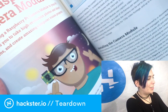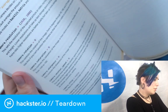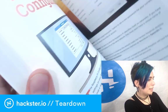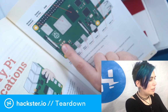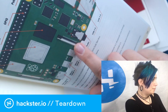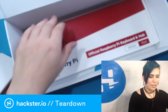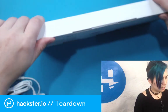And then the camera module, making your own little smart glasses, Python programming, more camera stuff, installing NOOBS to a micro SD card, and the command line interface. I mostly work on the command line with my Pi — I'll either SSH into it or occasionally hook it up to a monitor and keyboard and mouse, but I prefer SSH. Here are the specs for the Pi 4: your display port connector, CSI camera connector, and true gigabit ethernet — as opposed to before when it had to go through a USB chip. It no longer has to do that, so it can be a full real gigabit ethernet setup.